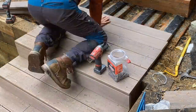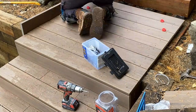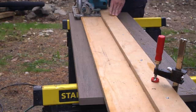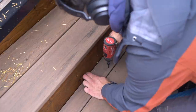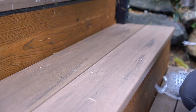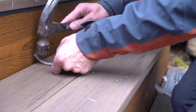These are the same Cortex fasteners used on the deck, providing an extremely strong hold along with their cap system that matches our decking. We didn't have perfect spacing for a full board at the very end of our landing, so we just ripped off a small piece and installed it like all the other boards. Now that all boards are fully installed, we cap them off with the Cortex cap system, which matches the decking boards perfectly.